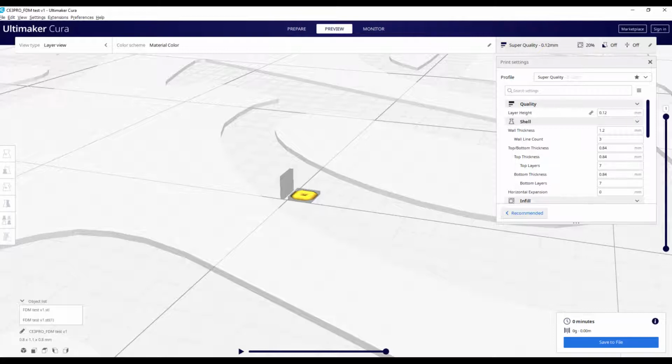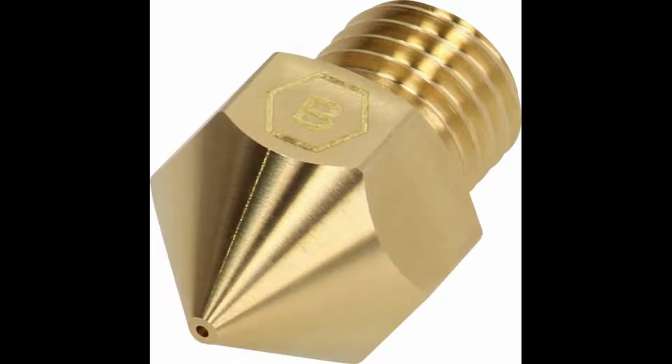At less than 0.8mm, parts are very delicate. This will make it very difficult to remove support materials without breaking the part, and you'll need a perfectly level bed to get it to work. This is a limitation due to how FDM works, as most FDM printers use 0.4mm nozzles, and to form a part, a nozzle needs to move at least the length of the nozzle.